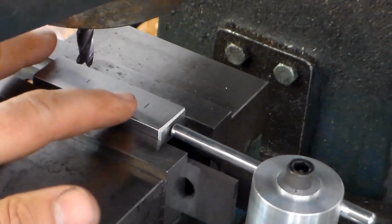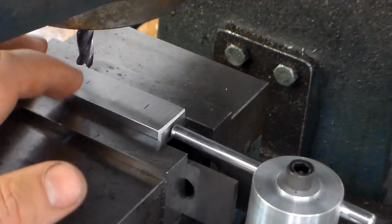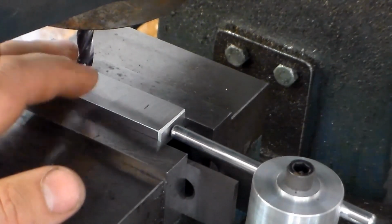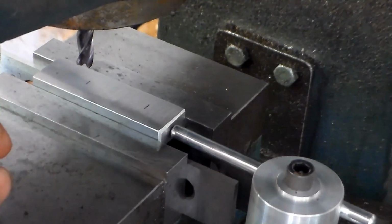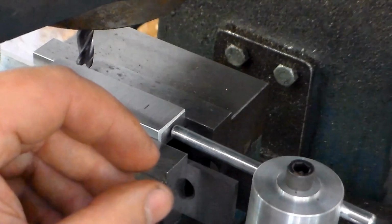Okay, we're actually going to come in and mill the backside first and make a slightly oversized pocket so that we're not fitting this full 400 thousandths thick guard material up to the blade. We're going to be fitting a shelf that's actually only about 35 thousandths thick.